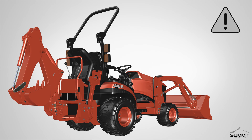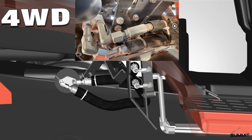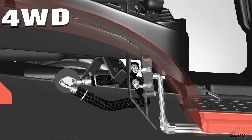Step 3: Pressure and return line installation. Please note: if you have not already, place chocks in front and behind the tractor's left rear wheel. Follow the factory procedures to remove the right rear wheel. Once the tractor is safely lifted, remove the lug nuts and the right rear wheel. Follow factory procedures to remove the inner fender to expose all of the hydraulic lines. Next, locate the power beyond port on the selective control valve (SCV) or manifold block. A hose will be connected from the power beyond port and routed to the return to tank port. Once the line is located, remove this line, placing a pan or rag underneath in case of fluid spill.